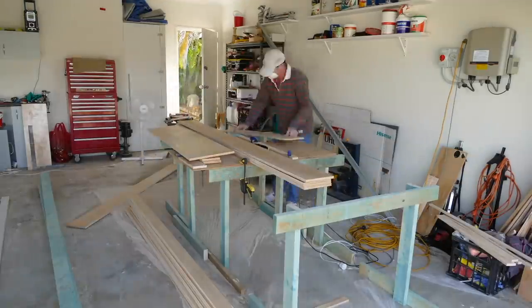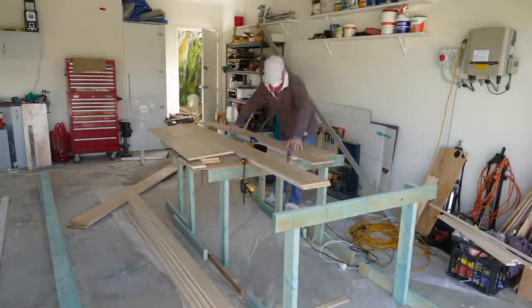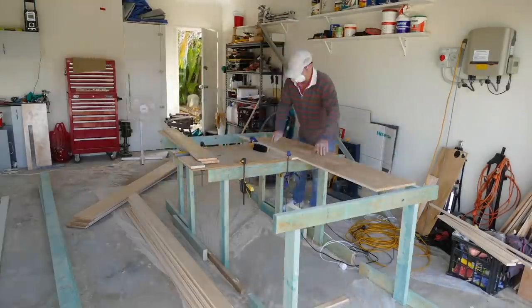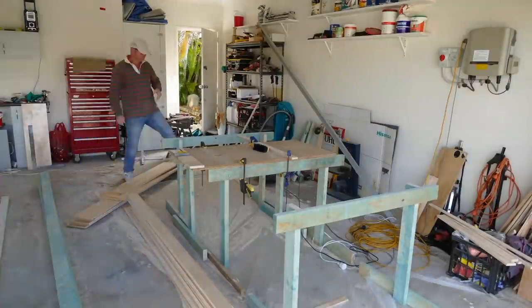Along the way, I made a few jigs and a basic table saw, which is just an old circular saw mounted under a thick piece of ply. It was very handy in cutting many lengths of ply of equal width with longitudinal slots to make drawer sides.